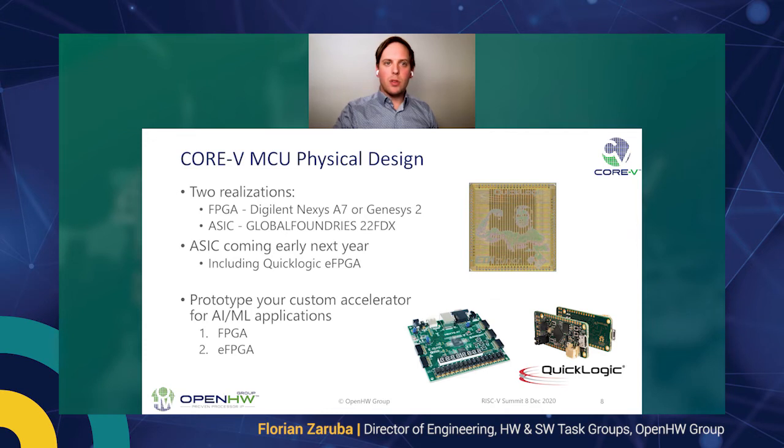So the Core 5 MCU comes in 2 realizations. One is the FPGA design. We currently support the Nexys A7 from Digilent, as well as the Genesys 2 from Digilent. And the second realization is an ASIC, which we are going to fabricate in 22 nanometer GlobalFoundries, hopefully at the beginning of next year, including a QuickLogic eFPGA sponsored by our member company, QuickLogic. And we also want to bring boards to the market in a limited fashion so that you can start prototyping.